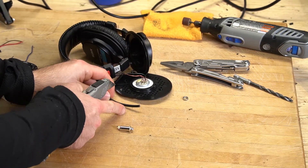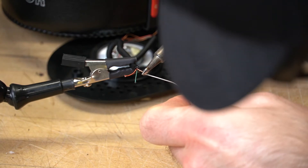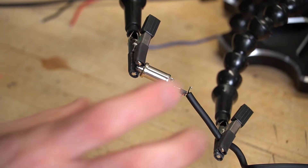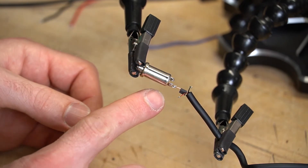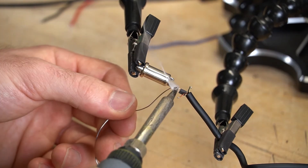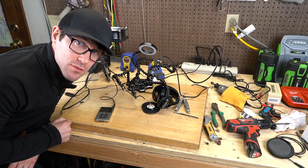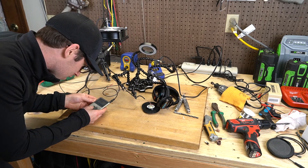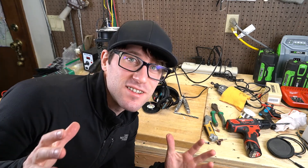While the paint dries I'm going to start prepping this end for soldering. The best technique I found was to put a big blob of solder on the end of your soldering iron and heat up the end of the wire for a while until you see the solder start to soak in. Just in case things get crowded during assembly, I'm going to add a little bit of heat shrink. The trick is to cut as short a piece as possible that will still cover the joint, and quickly solder it so the heat doesn't prematurely shrink the heat shrink. I still have an iPod — haven't used it for years — but I'm going to use it to test these for the first time. Yes! I didn't destroy them!